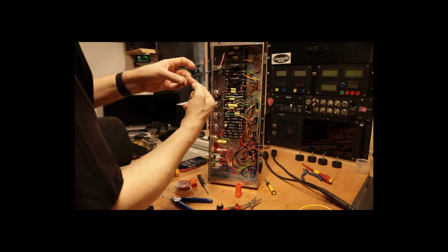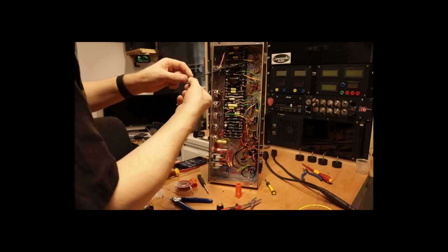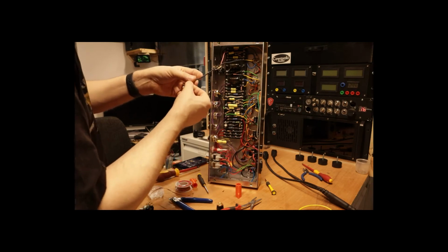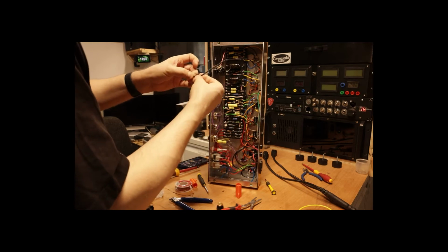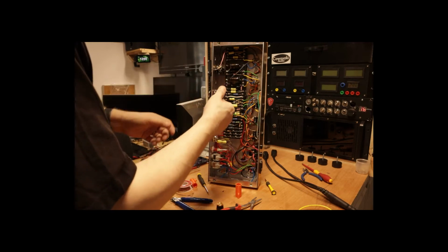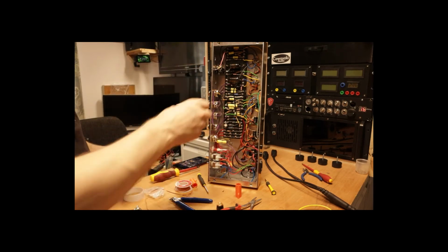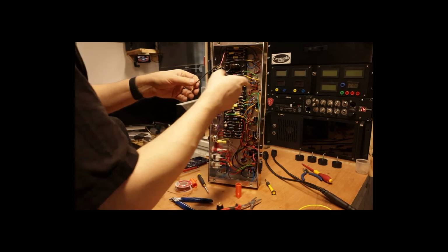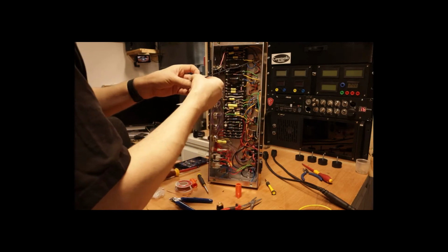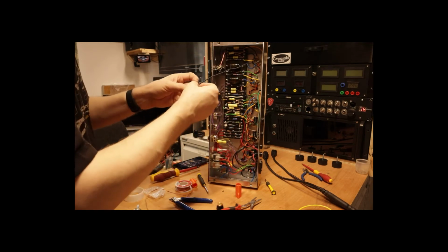This is a shielded cable, and I'm picking up the ground for the preamp cable, the shielding, from the body. Now just looking at it, I don't want to heat that up anymore, so I'm going to leave that for the moment. It's only connected at one end, so I'm going to leave that at the moment, and I'm going to actually jumper that to another ground.